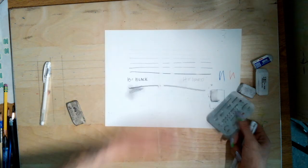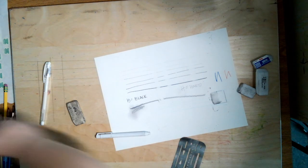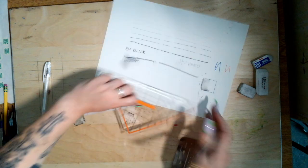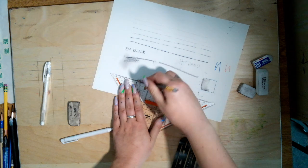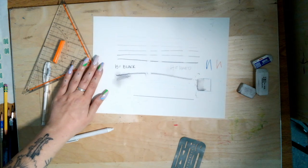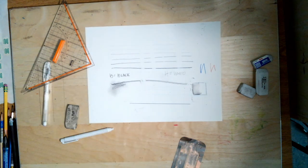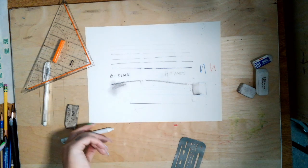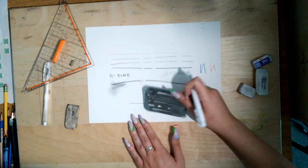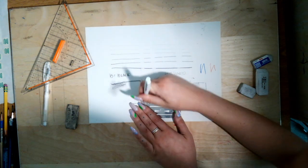So what you'll learn in this module is that hidden lines are, let me use a different pencil. I'm just going to make a straight line here. Whoop. And I did that kind of dark, but more because I want to make sure it's visible. Hidden lines are used to show edges that can't be seen in a particular view. And they are a series of consistent short dashes.